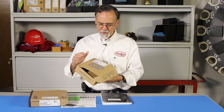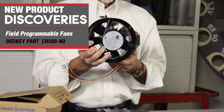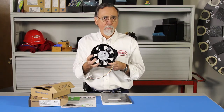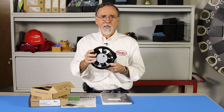Now in this case it's what I didn't know about. I'm showing a part that might have existed but it's new to me. This is a product from Comair Rotron and they make fans. It turns out this fan is a programmable fan. So what I'm able to do with this is monitor temperature, flow rate, and cause it to act in whatever parameters I want, so that I only have to stock one fan and can create a variety of operating conditions for it.